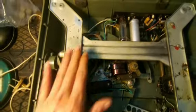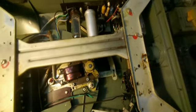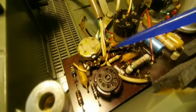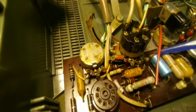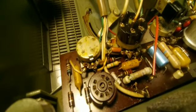First of all, I have to disassemble this unit. Once I disassemble it, the power transformer and output transformer will come out as well. Now you can see the condition of this circuit — there are lots of components which are actually broken. This one is already broken, and this particular resistance is not in very good condition. This condenser is not in good shape either, and this electrolytic capacitor — you can see the dielectric has already come out — needs to be changed.